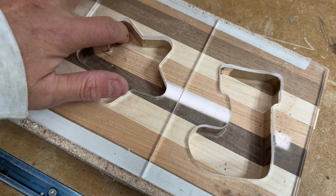Going back to the bottom piece, now that it's dry, I wanted this piece to extrude a bit for a visual effect. So I marked the wood around the halfway point, and then I added a few nails. Then I added glue and set the lid inside, and the nails ensure that it won't go all the way into the lantern, thereby creating this effect that I'm going for. The nails can then be pulled out once the glue is dry.